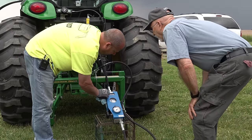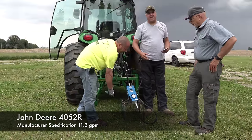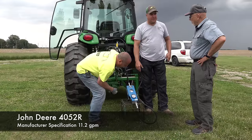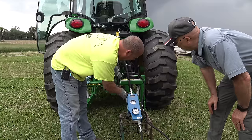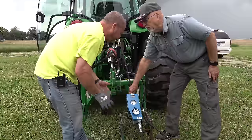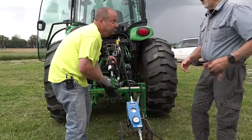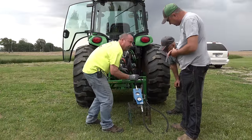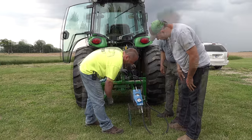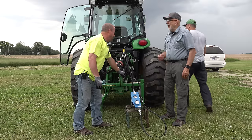Our temperature is creeping up — about 80 degrees right now. The specs say 11.2 for this tractor on the website. Sometimes we see discrepancies between the website and the manual. At about 100 degrees, we're still above 11.2 — we're a good 12 gallons a minute. Before the weather rolls in, let's get the front. I'm more curious about what the third SCV flow is up front.